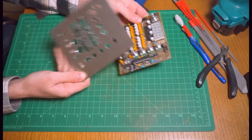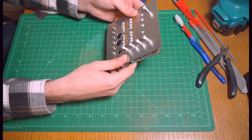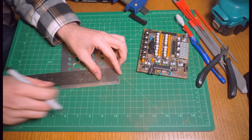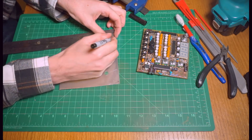After a little bit of work with the files we now have a nice press fit, so the next step is to put our mounting holes in the corners. Those sit three millimeters away from the top and seven and a half millimeters from the edge.